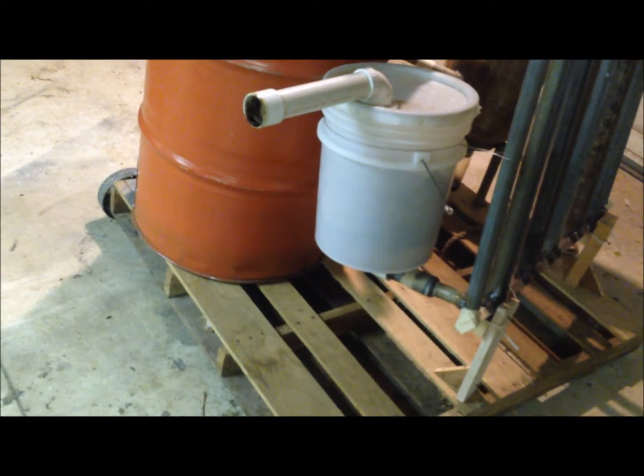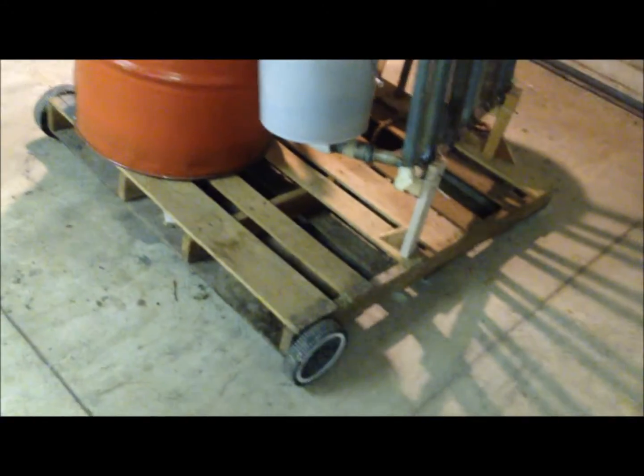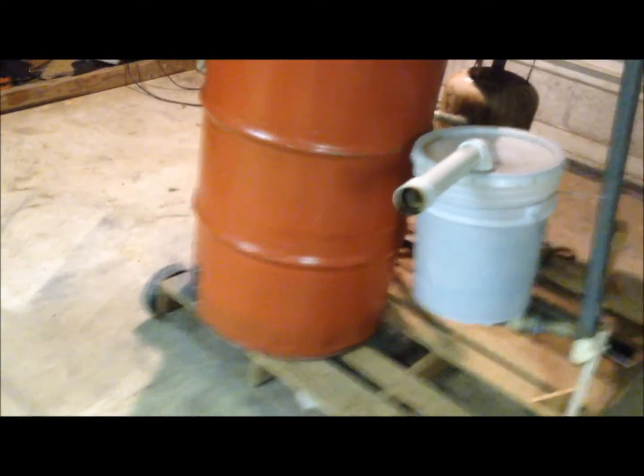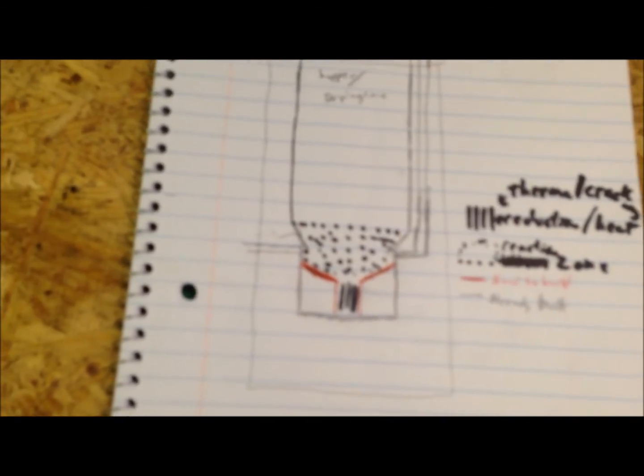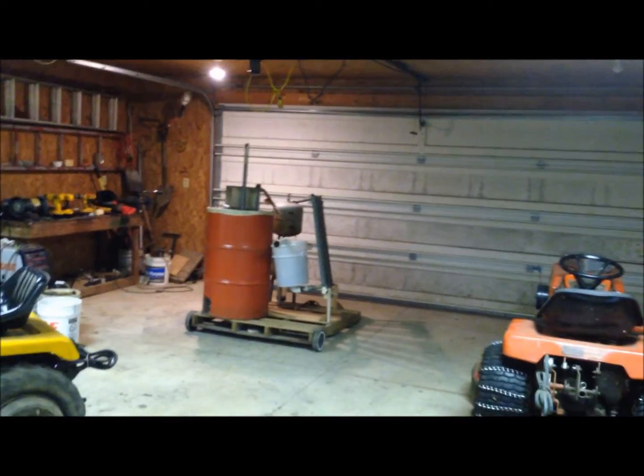The circulator is too short — I already mentioned I'm going to get two 30-gallon tanks. It's also hard to transport, so I'll put casters on it. Basically, before my next video I need to build the new reduction zone and the new thermal cracking area down in the bottom of the tank. Then I'm going to hook the blower up, make sure everything's sealed, and hopefully get out a video of a good clean-burning syngas run. That'll probably be within the next week because I need to take the whole gasifier apart to make that part inside.